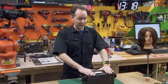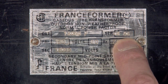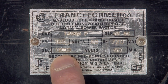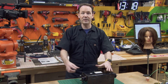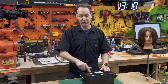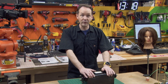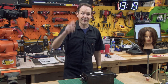That's the basics of how to decode a maker plate on a neon sign transformer. You've got your catalog number — which you don't really care about — your serial number — which you don't really care about because if it works, it works, and if it don't, it's garbage. Your primary volts, which is almost always 120, and your secondary volts and secondary milliamps — those are the numbers that matter. When I store these I just label them with a piece of tape. This transformer, which is 12,000 volts at 60 milliamps, is labeled 12/60 — that's all I care about. That's a 1260 NST. You guys have fun. I'm Chris Bowden, and as always, I'll see you next time. Thanks for watching.